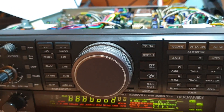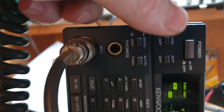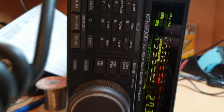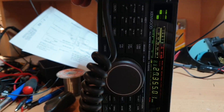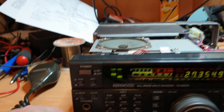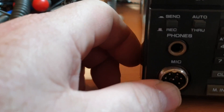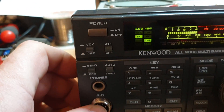With the VOX off, let me put this radio on its side — there's our VOX switch in: one, two, three, as it should. VOX switch out: one, two, three, four, five — it's doing a couple of crazy things there too. So whilst we've got audio fixed on this, we've got a couple of things to keep moving through. Have a look at this — that's a little bit loose, and that's not just the mic plug, that is the mic socket. They've got solder joints on the back and they can get really nasty. As I'm knocking it around it's not flicking into transmit, so more likely a VOX problem.